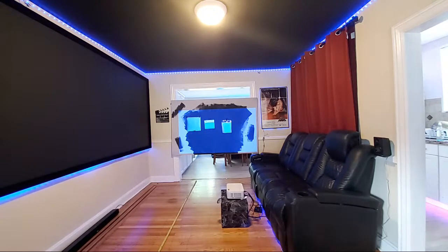The first thing they say to me, hey, Ken, look, I got a projector that's 6,000 lumens, 7,000 lumens. Of course, the reason why they use such high caliber projectors is because they have to calculate exactly how far the projector is sitting back and how much commercial lighting they may have in the environment. So they know they're going to lose about maybe 10,000 lumens. Some of them may have 50,000, 30,000 lumen projectors. They have to calculate how much light it's going to basically strip away from the lumens before it makes contact with the screen.